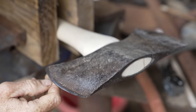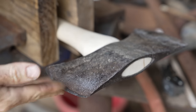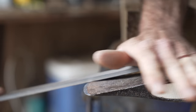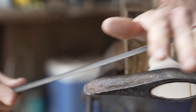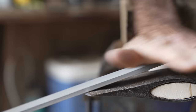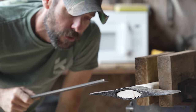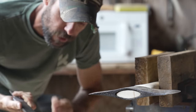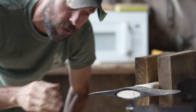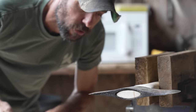There are some little dings right in here, so we're going to have to get below all of that stuff. You keep seeing me blow these metal shavings away. The reason I'm doing that is because sometimes they can get down into the grid work of your file and basically scar up the edge, so you blow that stuff away to reduce the risk of that.